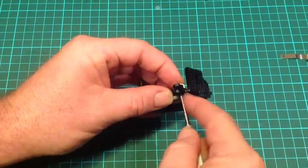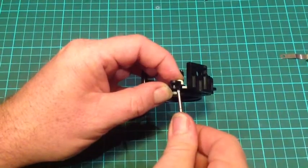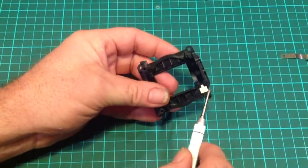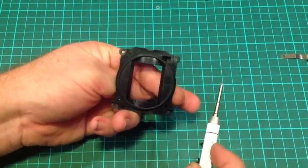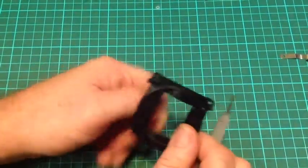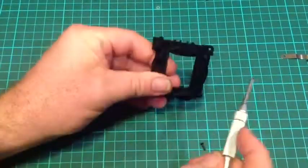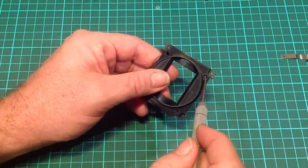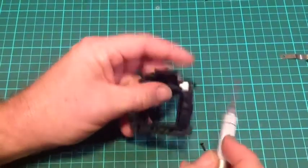There we go. So that's where this piece goes — it fits into the little bracket in there. The M2 screw: if for some reason you have difficulty finding one, you can remove the screw from this support rod, because we're not using the ratcheting part on this assembly. You can take that screw and use it to attach your catch piece. Remember to attach that catch piece nice and firm before assembling the unit.